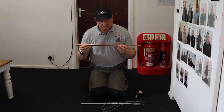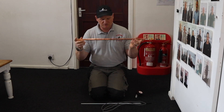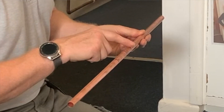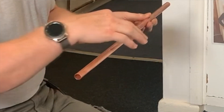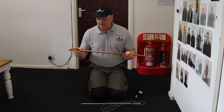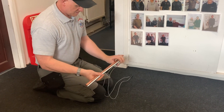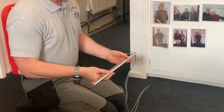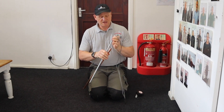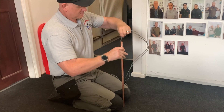I have measured my centre of the pipe measurement — which is number one — at 320mm from this end, because this is the centre of the pipe, so we're going to bend it here. I've come back four pipe diameters, so 60mm that way, and I've gone forward two pipe diameters, so 30mm that way. That's become our bending point for bending this centre-to-end measurement of 320mm. I'm going to flip that over and slide the spring in, first checking the centre of the spring is at the centre of my mark.